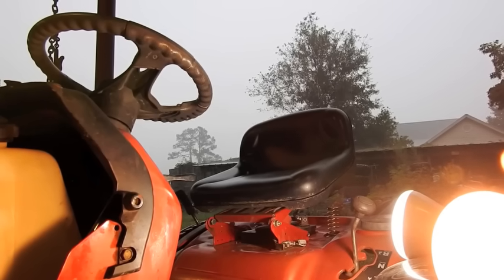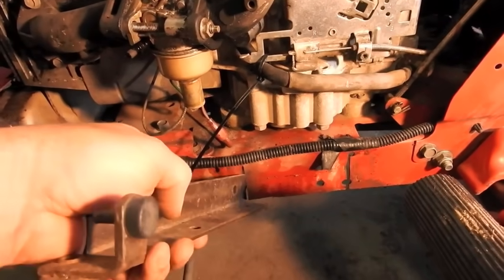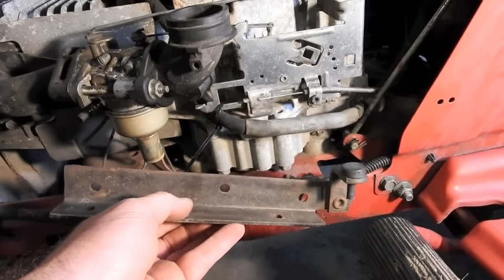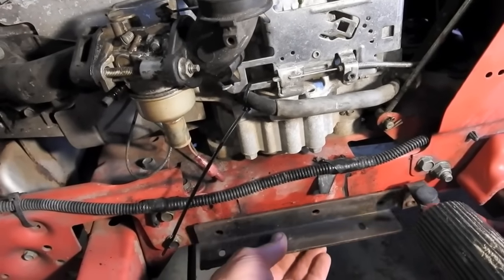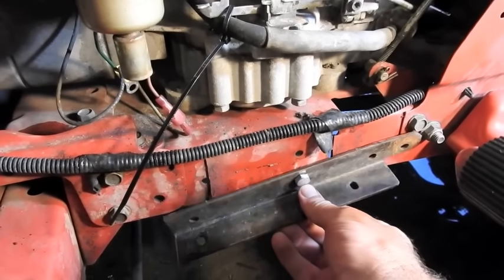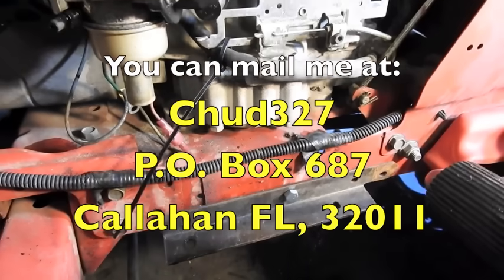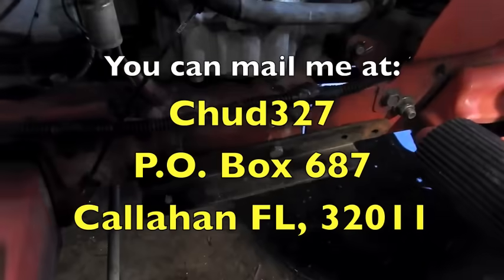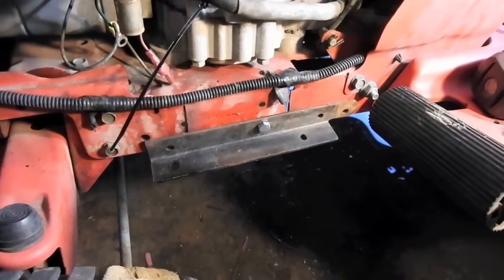I'm finishing up the Troy project and the mud hole is being filled as we speak. The last thing I'm going to do in this video — I had to do surgery on the frame to get access to drill a hole. I've got this piece of angle iron that came off of an adjustable bed or a couch. I cut off eight inches and I'm going to use the holes already in it and bolt it on there. There's a bolt hole in the bracket and a bolt hole in the frame — once I bolt that on, I'll drill here and there, three bolts, angle iron. That should strengthen it up and then we can paint it red. I also found a belt keeper that might go under there to keep my belt on better.